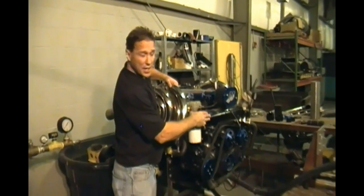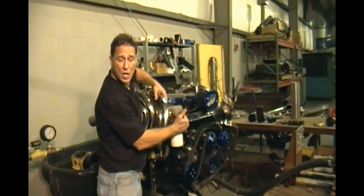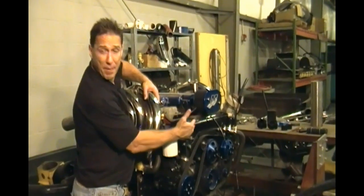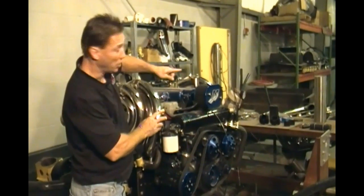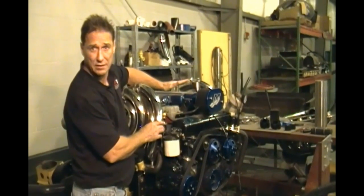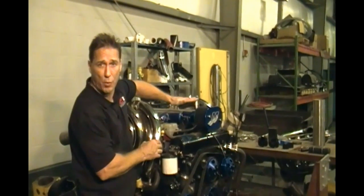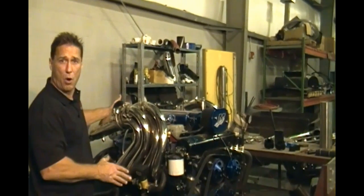Here we're at the heat exchanger. Once the water gets to the heat exchanger, it has to take several passes before it can go to the starboard and the port header. It takes three passes to come out the starboard side, and an additional pass to go out the port side. That's why your port header is often a little bit hotter — it's getting the last water and takes a little more to reach it. Then obviously it exits the boat.